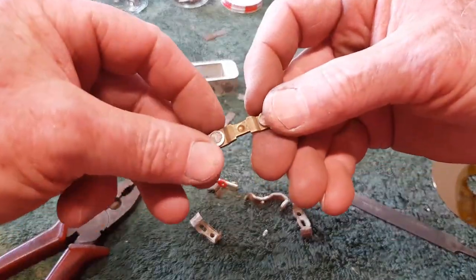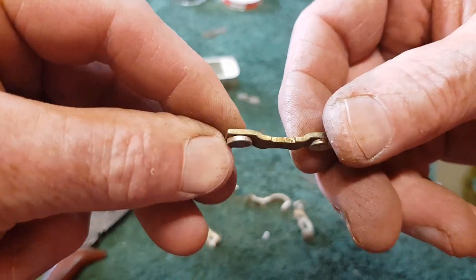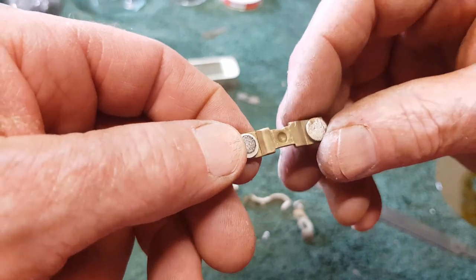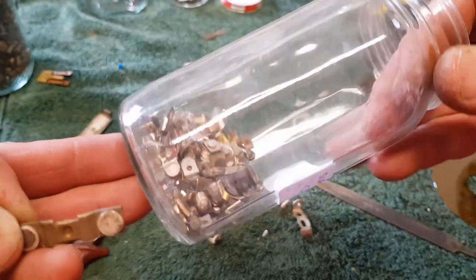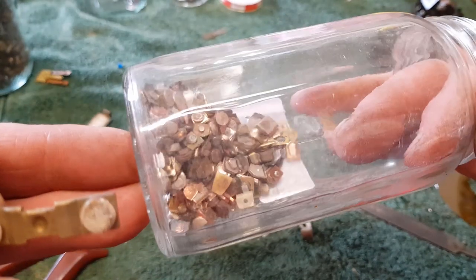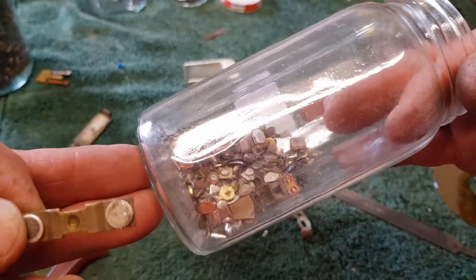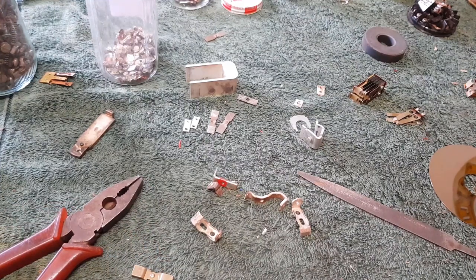You're also going to find electrical contacts, and that's part of what we're looking for, because contacts are silver — perhaps not pure, as they use other metals like cadmium and various alloys, and sometimes the silver is just a thin layer on top of a button of copper. I clip all the contacts off and put them in a jar. I could sell them on eBay for reasonable dollars by weight, but it's also worth considering refining them with chemistry down the track, though it is time consuming.